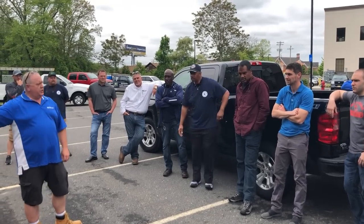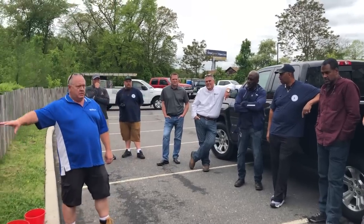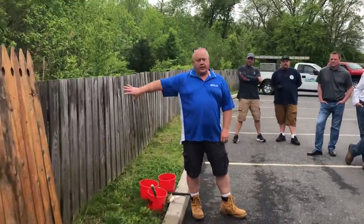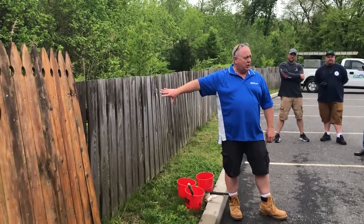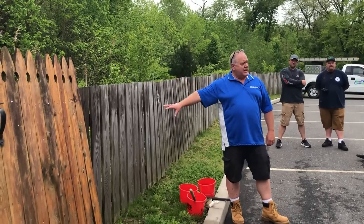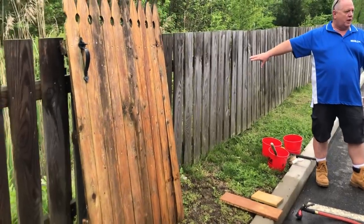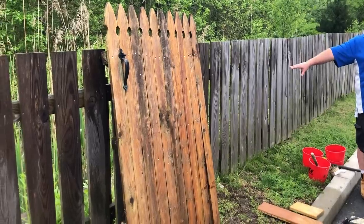If you have that gray surface, you're going to need to remove a coating. But if the wood's gray, you definitely need a little bit of moderate pressure to remove those gray wood fibers. That's wood restoration. Just throwing a cleaner or bleach on dry wood and letting it do the work, just bleaching out those wood fibers, it'll look unnaturally whitish. See how there's wood tone in that? You've seen when you put too strong bleach on, it's whitish. That's what we don't want. It's not natural. That's not the way to do it.